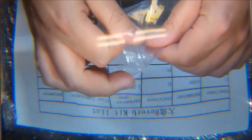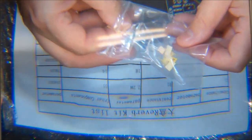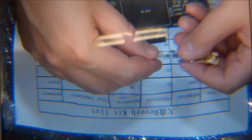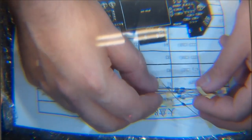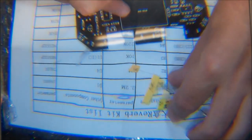So what we're going to do is start with the resistors, like we usually do, because they're the thinnest, flattest part. And these guys have a wonderful habit of labeling these, because these little 1/8 watt resistors are not always easy to read color-wise. So we have two of them that say 22K. So let's find the 22K here. Do I see 22K? I do.